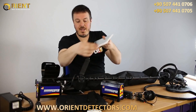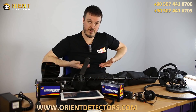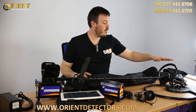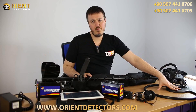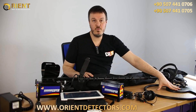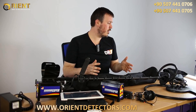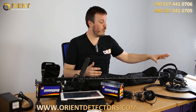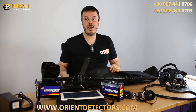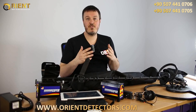You can mount the tablet on the shaft or use the special carry box we have. What's important is the coils. The 45 cm coil allows you to go deep up to 2 meters. The little coil is meant for tunnels and cavities and areas where it's really hard to go — a feature really appreciated by treasure hunters. But most of the time you will use what we call our big coil: a 1x1 meter frame that allows you to go between 2 meters and 5 meters depth.